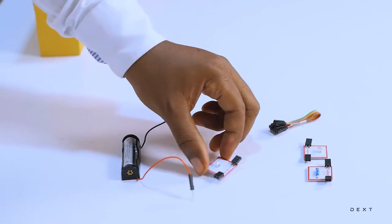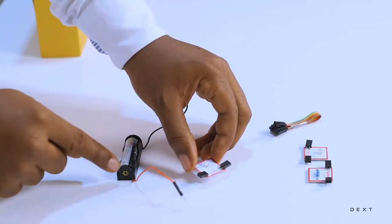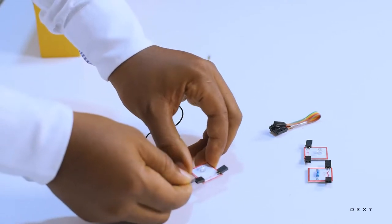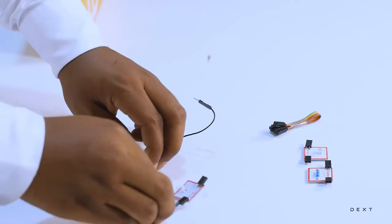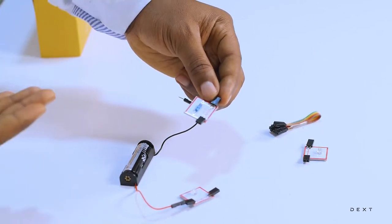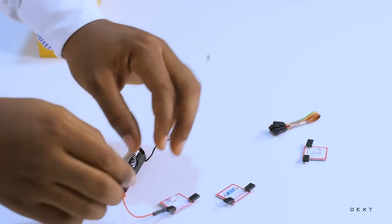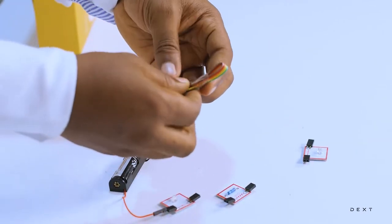The front of the arrow connects to the negative side. So we are going to turn it so that we can connect the positive side of the battery — which is the red wire — to our LED. And whenever we use an LED, we need to also use a resistor, which will lower the amount of current flowing through our circuit to prevent our LED from blowing up.